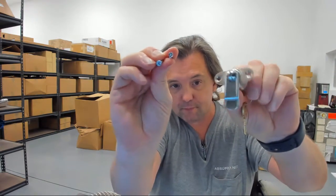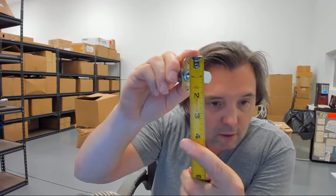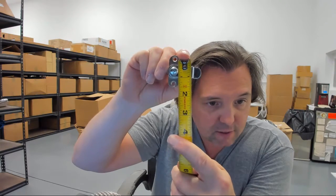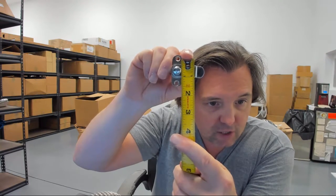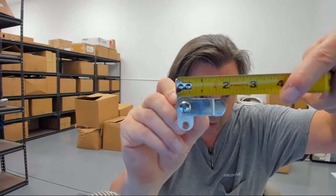Let's go over the dimensional properties of the lock and the tail pieces. You will also get screws required to install them. Overall length of the lock body on the back side is about an inch and three-quarters. Center to center on the mounting screws is inch and three-eighths. Width of the mounting flange on the back is about five-eighths.